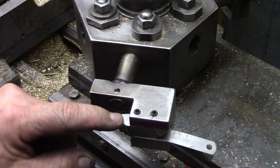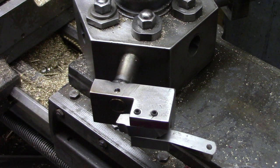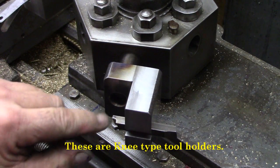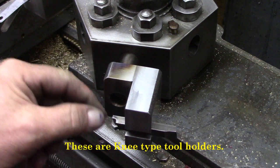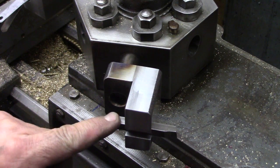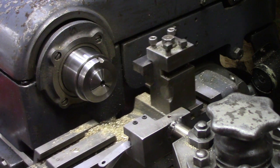The first tool we have here is just a right hand turning tool — pretty basic, pretty good size radius on there to make a real nice finish. Then we're going to come around, and this tool here is the radius for the end. I made this tool holder just for this — it could be used for anything, but it's a 5/16 tool holder and it's working very well. We're just going to come around and do a little radius on the end. Pretty simple — those two operations.